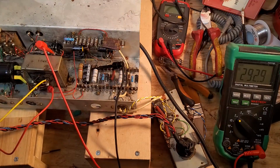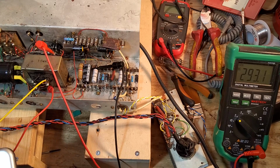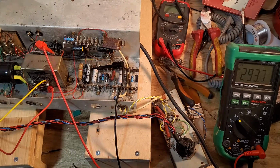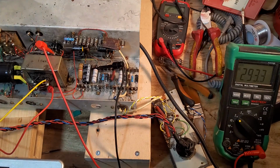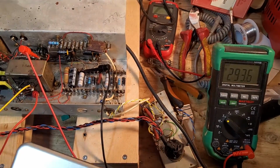So my estimation of 300 ohms for the resistors was virtually bang on, because remember, these tubes, 8.44, that's why that makes the screen flicker. 8.44 watts. These tubes dissipate at 9 watts. So that's come out bang on. Well, it has on that side anyway.